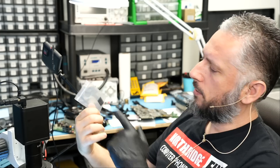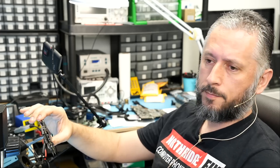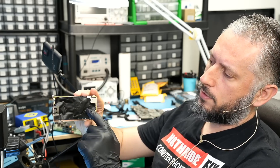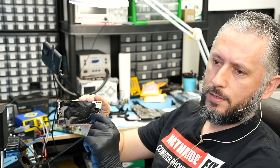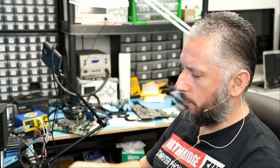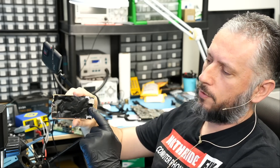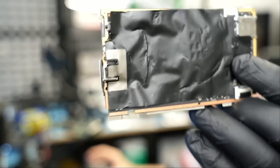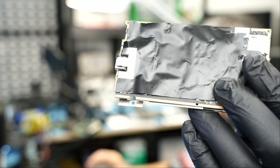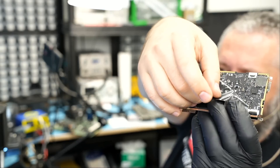I can see two chips here looking at the board with my naked eye. Assuming the customer wrote nothing on his ticket, I can tell we have a burn spot right on that piece of paper, so something must have been burning underneath it or got hot enough to burn the paper. We don't see burn marks elsewhere, but we do see a burn mark right over here — you can see how the port is bulging out.